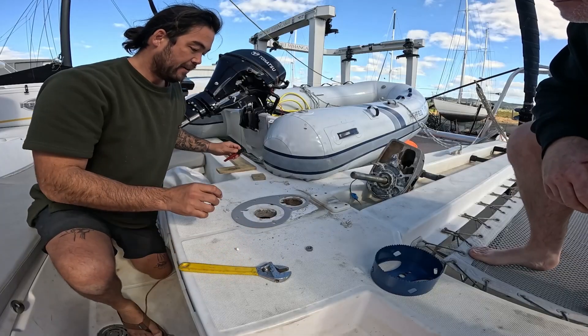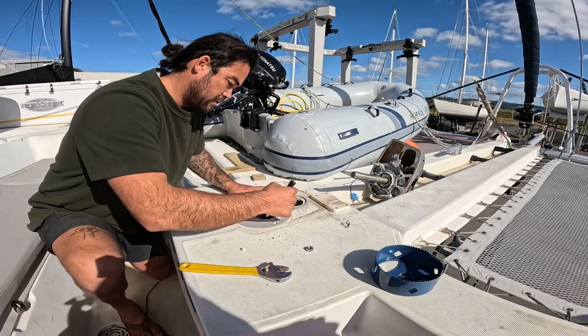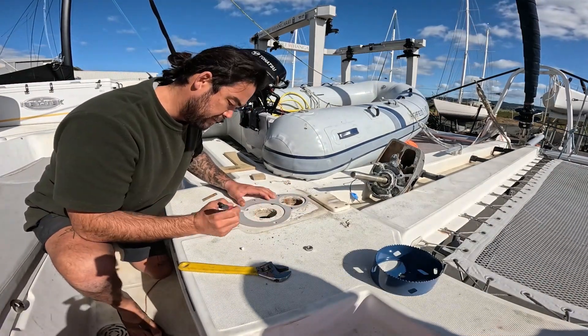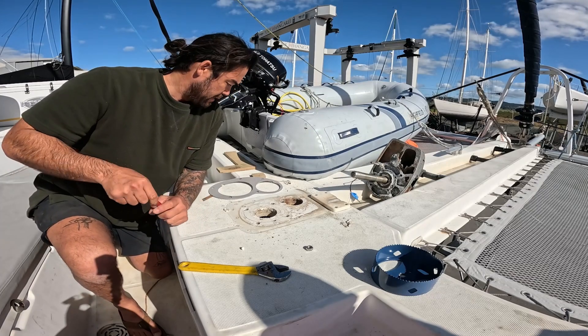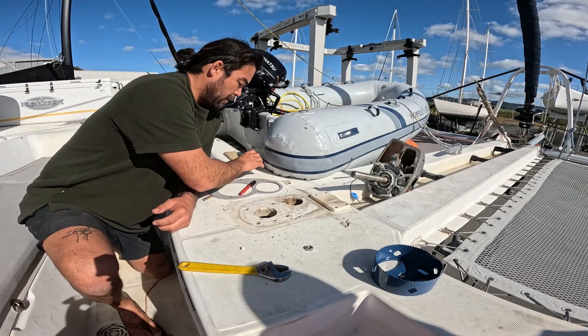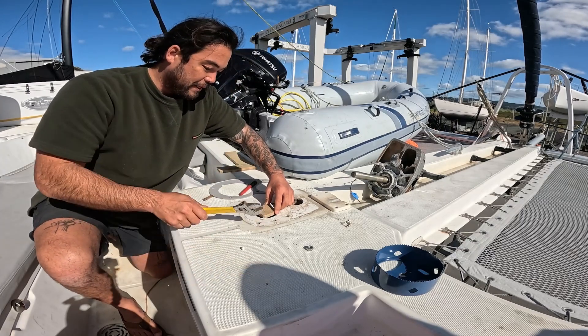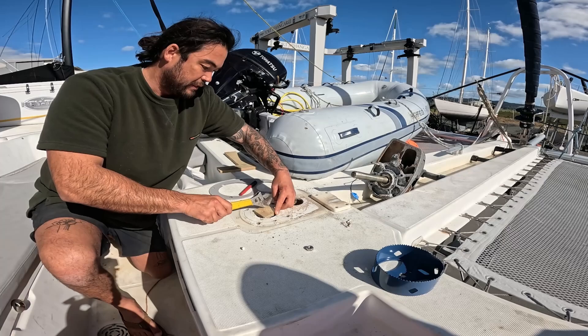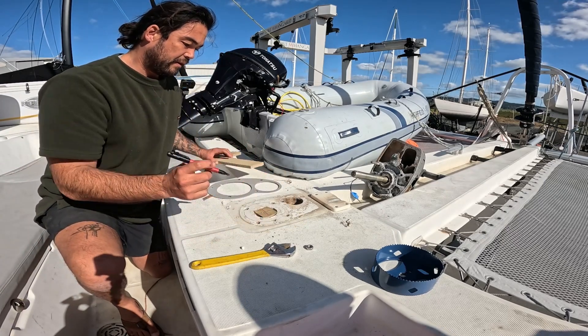Going to mark up the template for the new windlass. It's basically impossible to drill a hole where there's already an existing big hole, so I just found this block lying on the ground and I'm going to tap that in there. That's where we want the new hole.